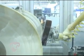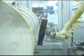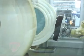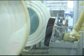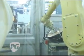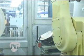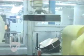Now that replaces the idea of a human being holding a 20-pound buffer all day long above a guitar surface. It reverses the thought process by bringing the guitar to a buffing wheel, applying just the right amount of pressure, and then moving it around the surface. More precise and much less repetitive motion illness, you know, carpal tunnel, stuff like that. Carpal tunnel, right, exactly.